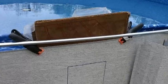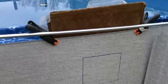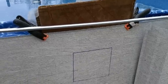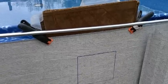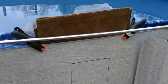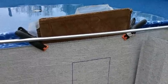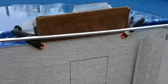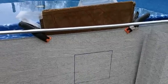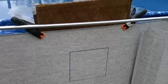I've slid some cardboard in behind my cut hole. I'll be using an abrasive cutter, so abrasion means heat. Putting cardboard behind a hot piece of metal probably wouldn't be the brightest idea, except this cardboard is wet from a pretty heavy rain — which is probably why it's 40 degrees out here. The wet cardboard is going to be hard to get hot enough to start a fire, and I'll be moving fairly quickly, so I'm not worried about that.